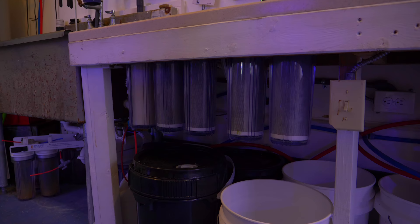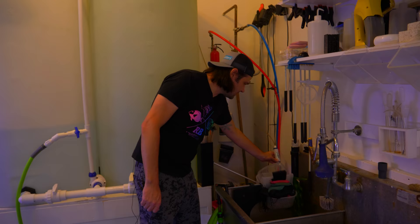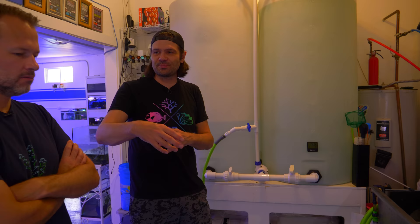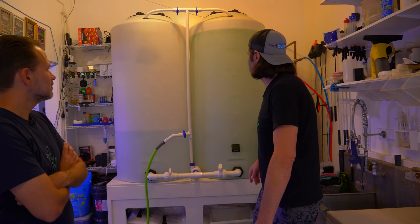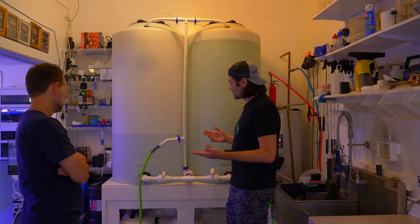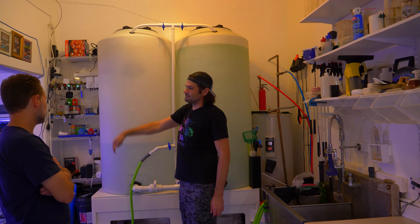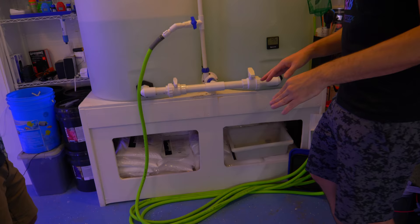We just changed the mechanical filter for the first time in three years about two weeks ago. Then we have four very high-capacity carbon blocks, each rated for 5,000 gallons — 20,000 gallons total. I have a digital flow meter that tells me how much water I've processed — I'm up to 1,204 gallons. Once that hits 5,000 gallons I change out all the carbon at once. It's about 50 bucks for 5,000 gallons — a penny per gallon. This whole system was built holistically from the beginning — I knew I wanted to store salt and have the vats a little higher in case of a power failure.